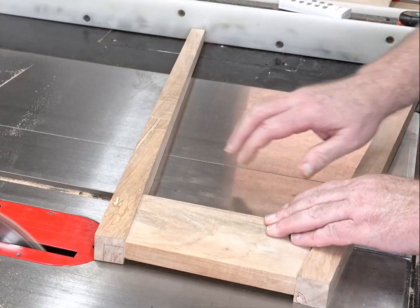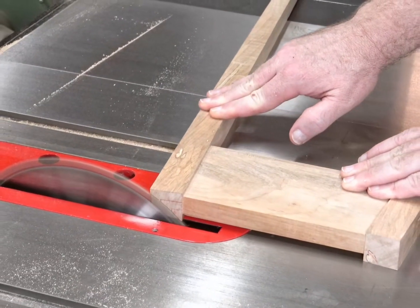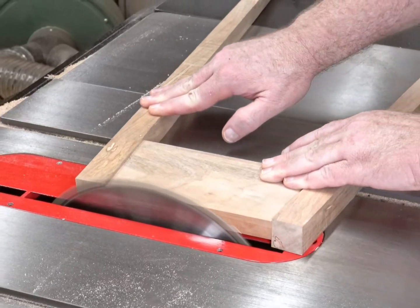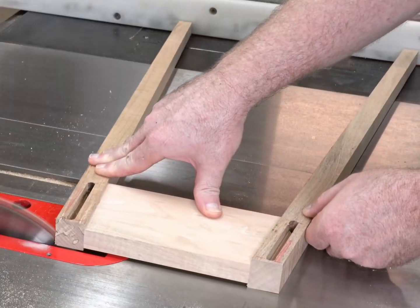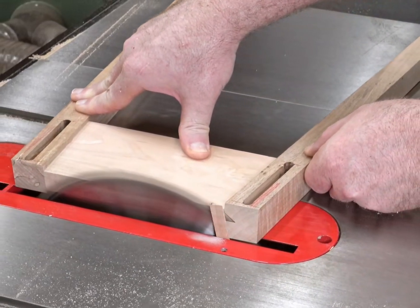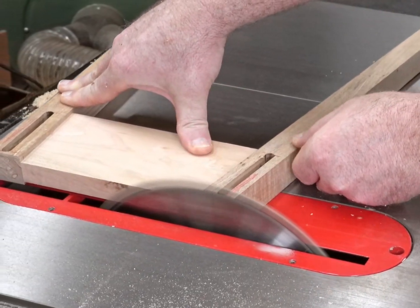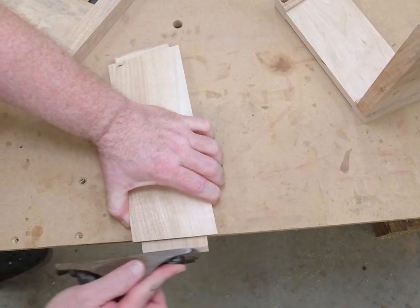With the bottoms of the legs cut correctly, I inadvertently decided to cut the tops in the wrong direction. The method worked great, but with all the light and camera setup, I got the woodworking wrong. Hey, you gotta let me blame it on something, right? Once I discovered my mistake, I flipped them over and cut them in the right direction. I lost a little height from the table, but it's not going to be noticeable. I'm glad I left a little extra meat at the top of the mortises because I pretty much used it up here.